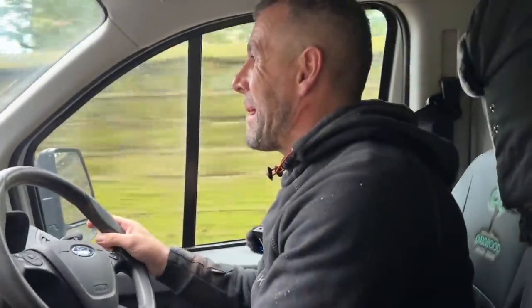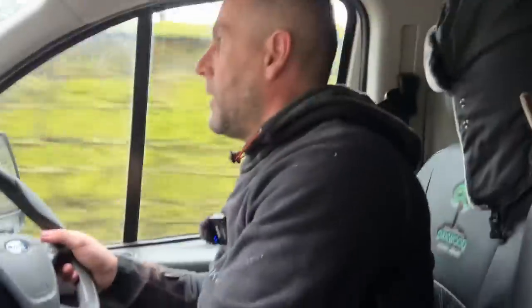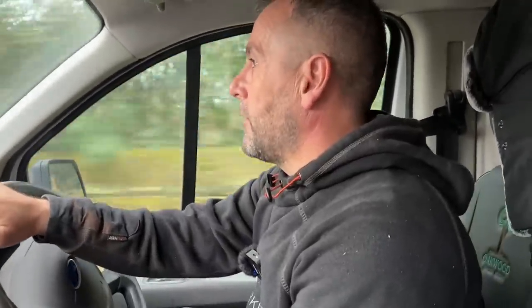Adrian has a shed that needs replacing - it has an insulated concrete pad. How would he finish the floor? If it's just a shed I wouldn't worry about it, but if you want to use it as more than a shed and it's insulated with a DPC, you can lay what you want on it. Go for LVT - luxury vinyl tile - it's waterproof, really easy to fit, and has good wear on it.